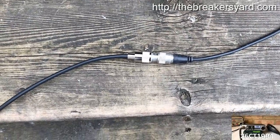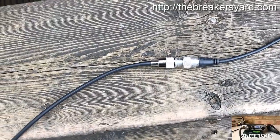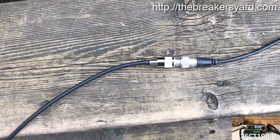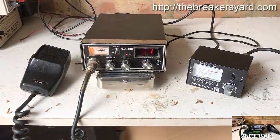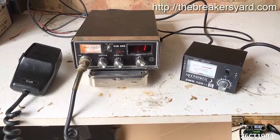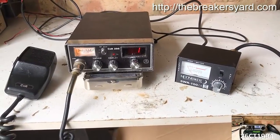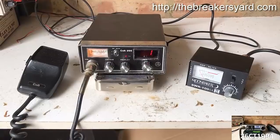So to show you the two sections of antenna joined together — we'll get a SWR meter out, get the radio switched on and start doing some testing. I've got everything loosely connected up now, got the SWR meter on and running the cable out to the antenna, and then a patch cable running into the back of the radio so we can start testing for SWR.